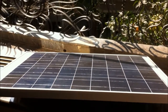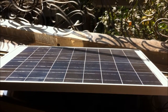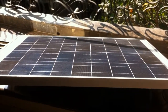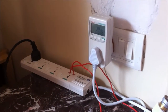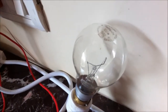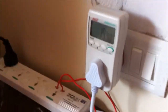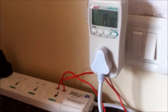Hello, so what I'm going to show you today is how a grid tie inverter works, which is also called a grid tie system or a grid connected system. The essential components are these: a solar panel, the silver box over there is a grid tie inverter, and this is what you might call a net meter, which shows how much energy is being generated. This is a load — a 100 watt incandescent bulb. This is a basic power meter which tells how many watts of power have been generated.